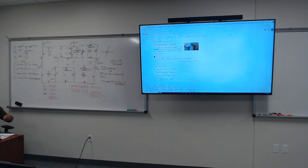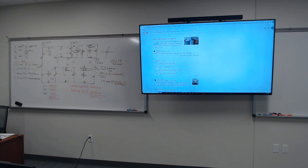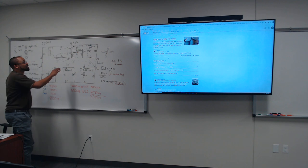All right. So we're going to say that light and that ceiling fan is 75 watts. The reason why I'm doing that is because I'm gonna put the whole master bedroom on its own circuit breaker. Right, the lights and the ceiling fan? Yeah, the light and the ceiling fan. What are your reservations? That 75 watts is for just the fan. Or we can say we're putting in LED or something that doesn't take up a lot. What is the normal wattage of a residential ceiling fan with light? Let's take it at face value. 75. So this right here is 75 watts.